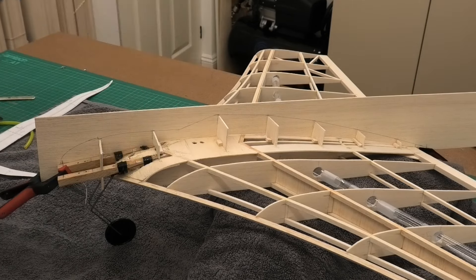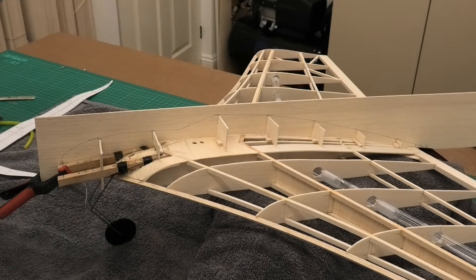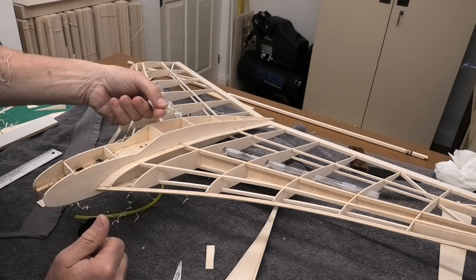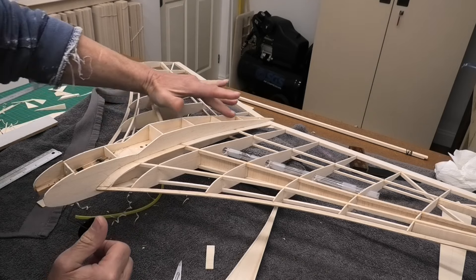As you can see, I've been cracking on and we've got the fuselage sides glued in place, nicely sanded and profiled. Initially they were a little bit oversized by design, and I just took a plane to them and carefully took them down to the top of these formers, then sanded them to get that finished profile. I've put in a little bit of packing here just to strengthen where the engine bearers go onto the sides. And I'm ready now to start sheeting it.